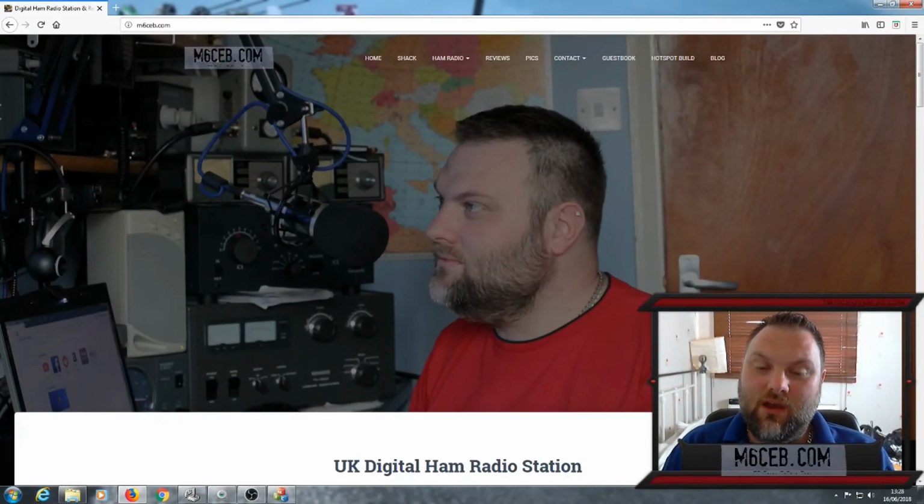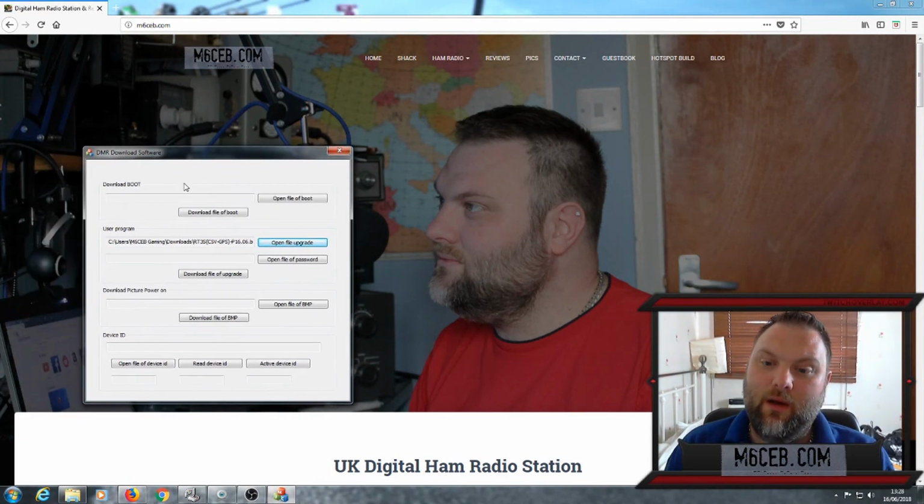Right, I wanted to just quickly show you how to update the firmware on the radio. A lot of you probably know how to do this, but basically you get the firmware update tool. I'll leave the files on my website until Retevis, because obviously it's a brand new radio, have done an updated firmware for it yet. So I have the original firmware that the radio ships from the factory with until they've updated it at their end. So you can head over to my site and download it. You'll have 3 files in there. One is the update tool, which is here, and then you have the 2 firmwares. One where you can record 8 hours, or one with CSV contacts, so you can choose either one.